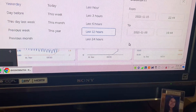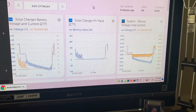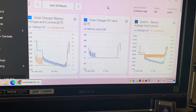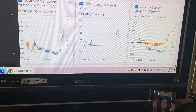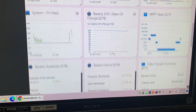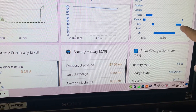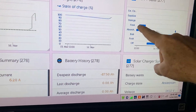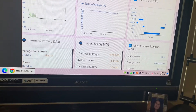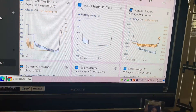So you can change your views here, and as I was explaining before — with the Bluetooth limitations — I can get this anywhere. As long as the Cerbo GX is able to connect to the internet and I can connect to the internet, it's updating my VRM account and I have this visibility literally anywhere. You can see how much information is here — so many different graphs and charts. Here's my MPPT state: it was off all night long with no sun, then it came in and immediately started bulk charging. We've already gone to absorption, and pretty soon it's going to start floating again once the batteries are totally full. Every 15 minutes the Cerbo GX goes out and updates the VRM account with this info.